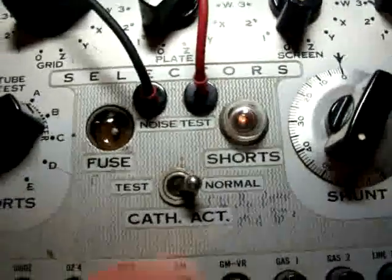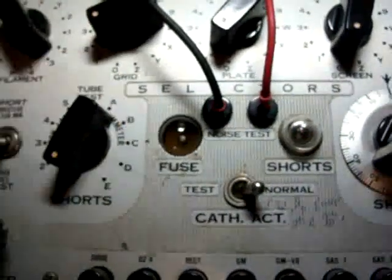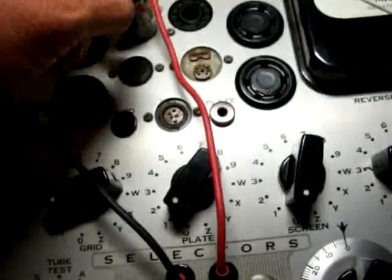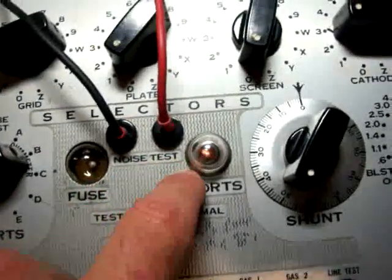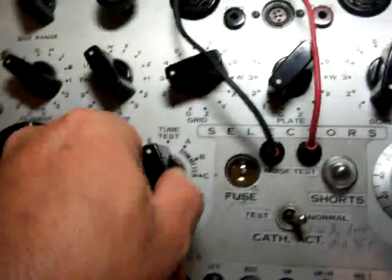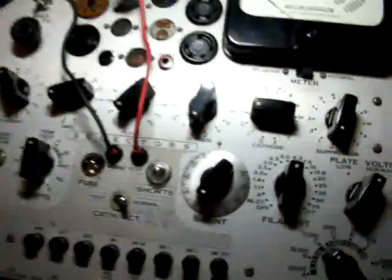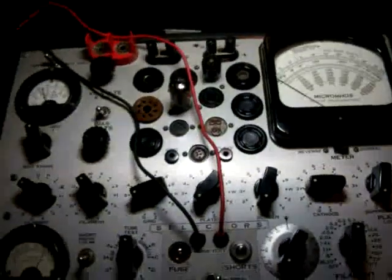Let's check out number 1, which is another part of the tube. Tap it — no bad deal there. But here, you don't even have to tap it — it makes the radio react; you can hear it. And again, that's just hooked into the antenna. The noise — very cool. Now, when you get a short or a sign that something is not right on this part of the tube, don't continue your test. Don't put this back on tube test and mash your P4 button — it's not good for it; you can screw up your transformer. When you find your tube doing that, it's noisy. If you've got a short, discard the tube, because I know some of these tubes are worth a lot of money.